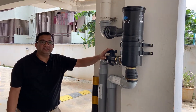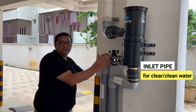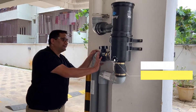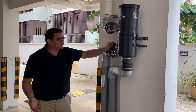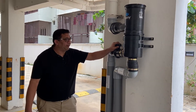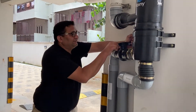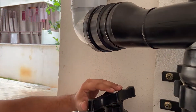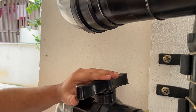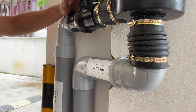The relatively clear water flows through the inlet pipe and gets into our storage or recharge structures. If we do not want the water for some reason — for example if they are doing waterproofing or painting on the roof — one can just close this valve. When this valve is closed, no water gets into the recharge or storage structure; all the water flows into the waste pipe and gets drained out.